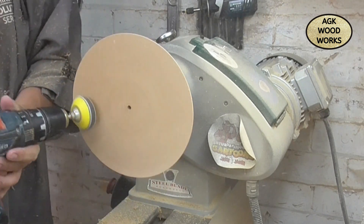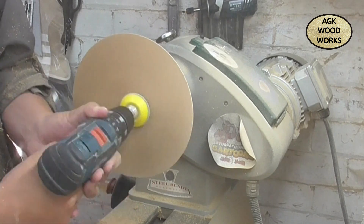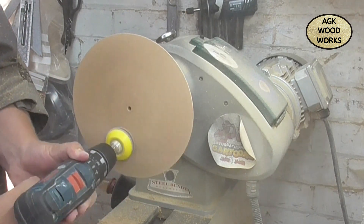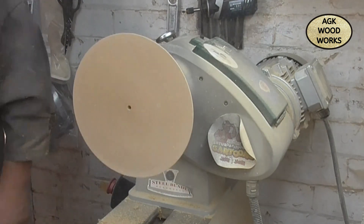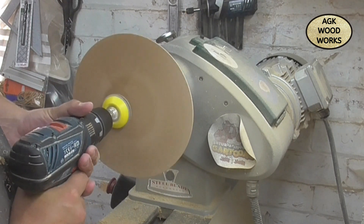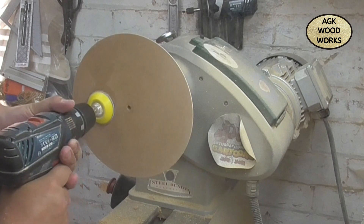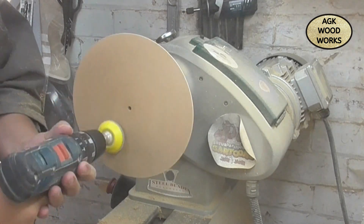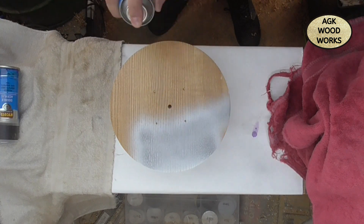This time I'm going up to 400, because we're going to apply paint on there and I wanted to make sure I could get that piece as smooth as possible. After I finish sanding I do put some sanding sealer on, then I de-nib it.